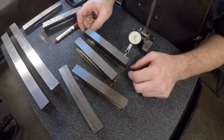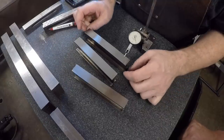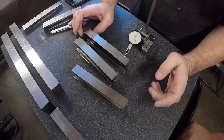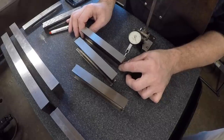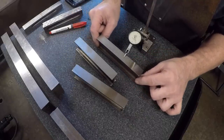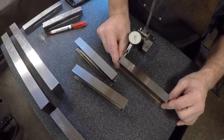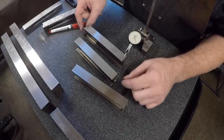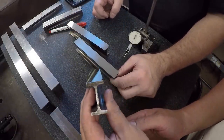So Adam and I have been on the grinder here for probably too long. He's super patient. It's like watching grass grow. But these I-beam parallels that he brought, we do have them all cleaned up, and they look great. One of the three of these is pretty stable and repeatable in terms of measurement. But I don't know if the mag chuck is influencing these because of their shape, but we're definitely getting some variation in these parallels out on the wings of the I. If we stay in the middle and don't influence this left to right, we're definitely within a tenth. But as we start drifting out very inconsistently on these non-supported areas, we're getting some variation. So I don't know if it's the influence of the mag chuck, or if the material is not stable. I'm not really sure. Love to have you guys comment.